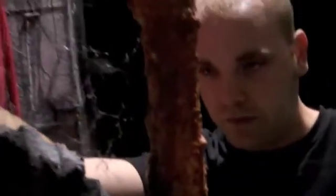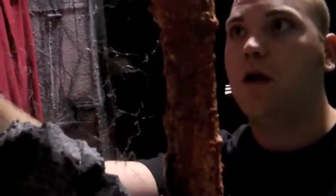And the problem that I found, we've never done this before, but if you guys look close, if you spray Durabond on expanding foam, it cracks off. We're just going to have to paint this because this is probably at like the 7-foot level, and it's just cracked. Aaron and Kyle put pipes in here, again textured with. Is this plaster or expanding foam? It's expanding foam. Textured with expanding foam.